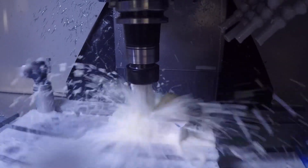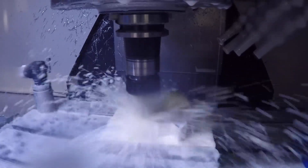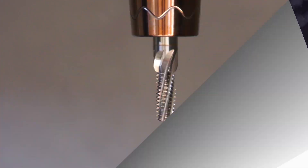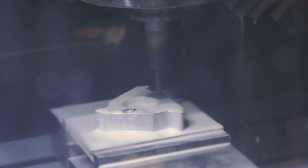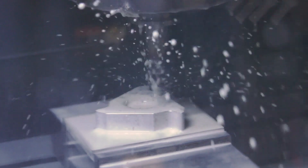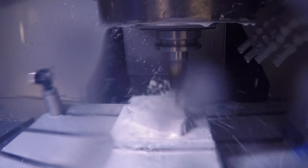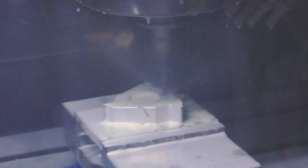On the drilling, tapping, and chamfering demonstration versus the multi-purpose tool — we've drilled and tapped three holes conventionally, thread milled, and the cycle time with our 3-in-1 TMDR tool is actually 40% quicker than the conventional method. Other advantages include only needing one tool, freeing up two extra positions in your carousel. And on driven head lathes, you don't need three driven heads to produce a thread.